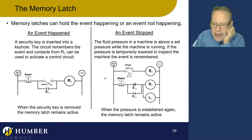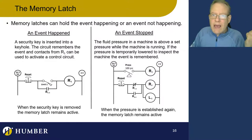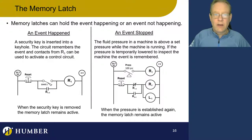Looking at this circuit: when the pressure is up, the pressure switch is closed. When it goes below 100 PSI, that becomes open, and relay coil R1 de-energizes. Therefore, contact R1-1 goes back to its normal state and becomes closed — relay 2 energizes because the activation contact became closed. When the pressure goes back above 100 PSI, that contact becomes closed, and R1-1 goes to its active state which is open — but the light stays on because we're remembering an event went away.